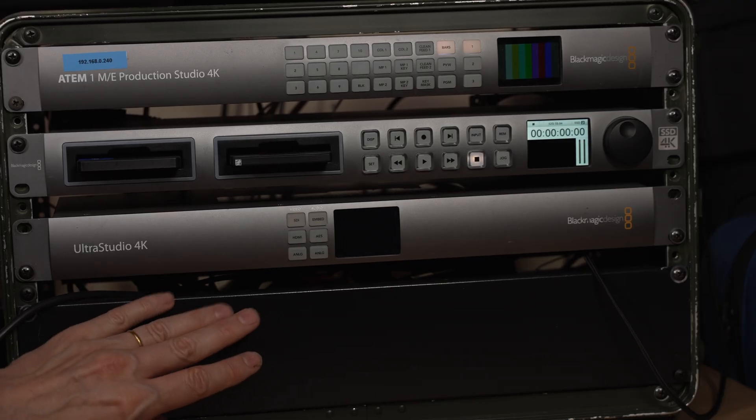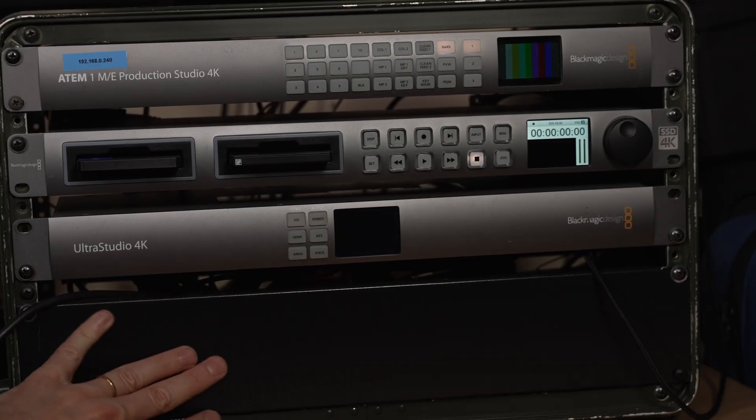I can also use it here in the office simply as a way to get SDI and HDMI input and output from DaVinci Resolve. What's really important about this that I don't think a lot of people truly appreciate is that if you use a proper dedicated video IO, rather than your computer's built-in HDMI, you're guaranteed to get the correct colour space, your colour management will be perfect, your levels will be perfect — there's none of these gamma mismatches that can often occur when you're using a computer's built-in HDMI port for monitoring.